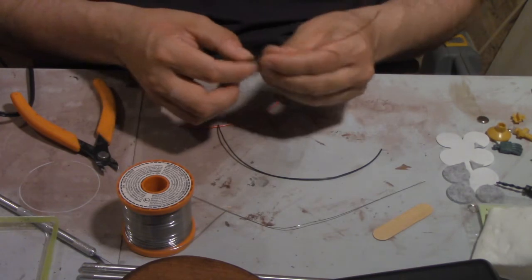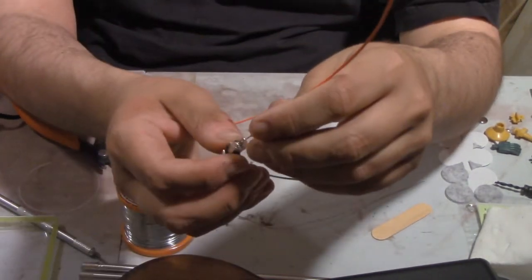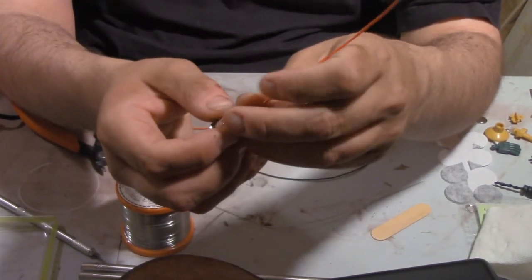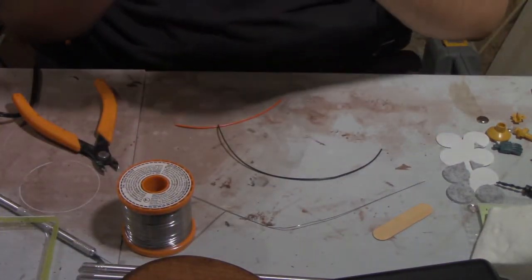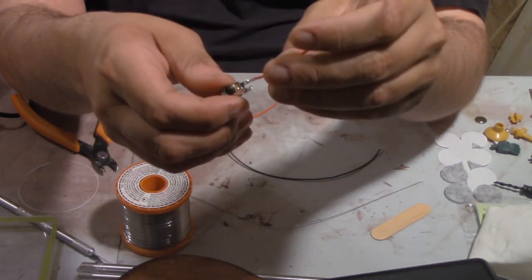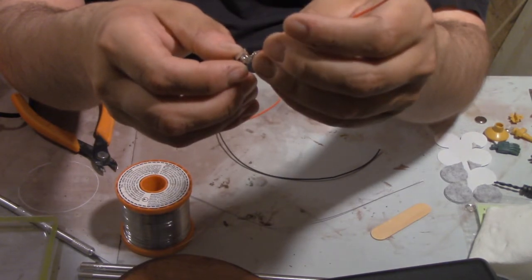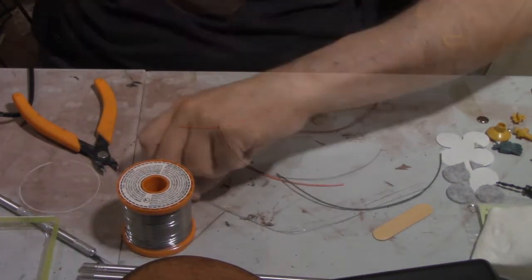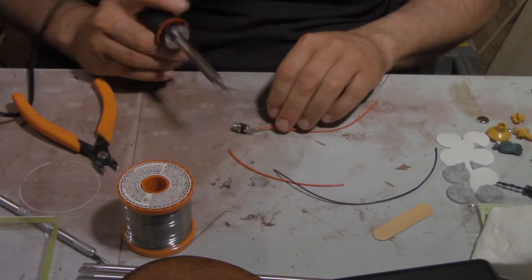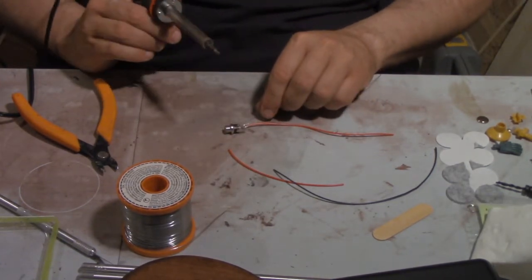I like to put a little bit of a loop onto the wire so that the thing will hold in place, because I don't have any helping hands and I really need some. I always like to do this little loop to hold it together while I'm soldering it, and then once that's done I just trim off the stub. That usually works pretty well. Now I am no expert when it comes to soldering — I never have been. I'm decent at it, but I'm no professional.